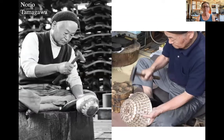So he learned a lot from books that had been written down in history and really revived the art of Mokume Gane. He's a living treasure in Japan. He is still living too, in his late 70s now, and still raising vessels made with Mokume Gane. For those of you that have done raising, you'll see that in Japan, they raise, in the West, we would call it backwards, and also understand the thickness of the material. He likes to raise with material that's no thinner than 2 millimeters. In fact, usually it's 3 millimeters.